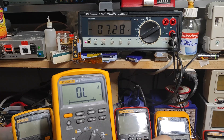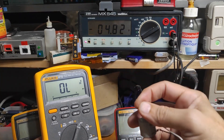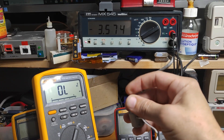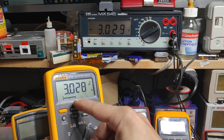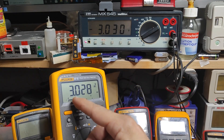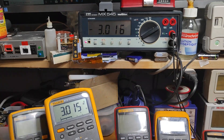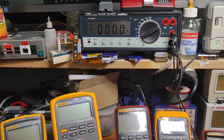If you put the diode simulator in, you can see the voltage dropping to 4.8 volts. When the voltage is very low, it's not able to detect something, but as you decrease further it becomes able to see something. So the probing voltage is about 7 volts, and the efficient voltage range for probing is about 3 volts — compared to only 2 volts for the Fluke 117.